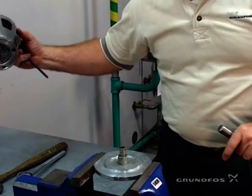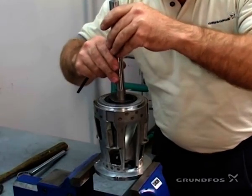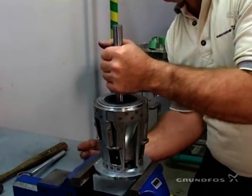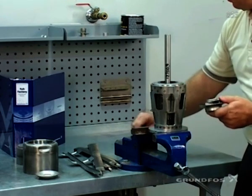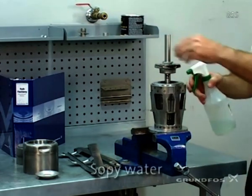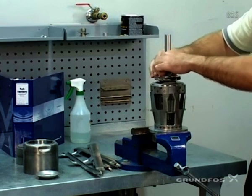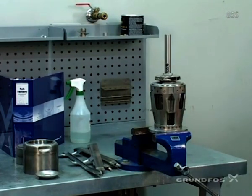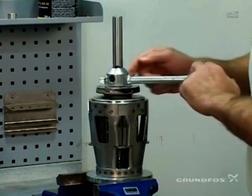Leave the spacer in place. Take your inlet, put down, and put your shaft down over the top. Put your bolt back in place. Make sure you tighten your shaft back up. Take the impeller — remove the up-thrust washer so as not to damage it when you put it down. Slide the impeller down, and just before seating the impeller, a nice squirt of soapy water. Put your drivers underneath to pull that up, from the seat to get it in place. The inlet shouldn't be lifted at this point. Take the specialty wrench that goes over the shaft and tighten down the split cone.